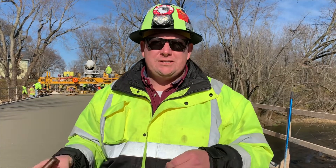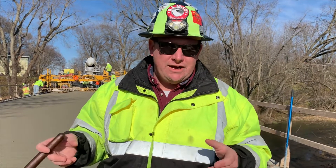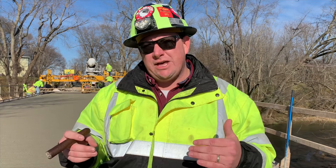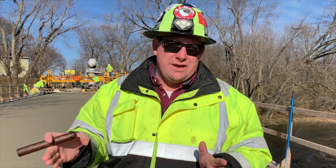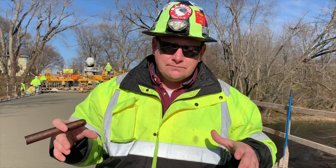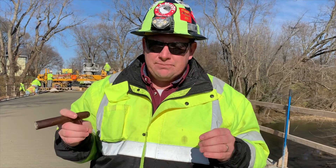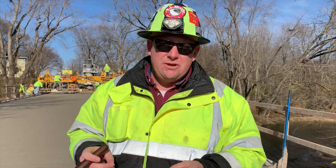What I've done is I've taken the technology that Specification Products has come out with — E5 internal cure, Element Five — and their nanotechnology. We've originally used that on bridge decks as an internal cure mechanism and found really great things with it. Not only did we not have to wet cure after, because the cure was internal — as you can see behind me, there's no bleed water — so you know that water is being controlled and saved for hydration. But one of the first things I noticed as a bridge contractor and a pumping contractor was that pump pressures, actual pressures to the concrete pump, went down with the use of E5.